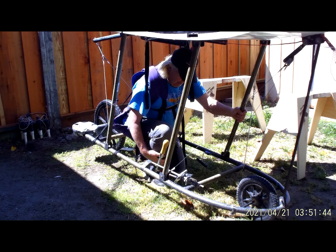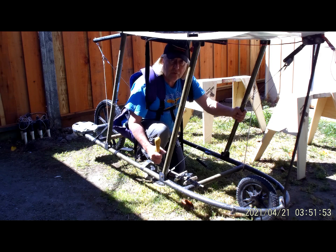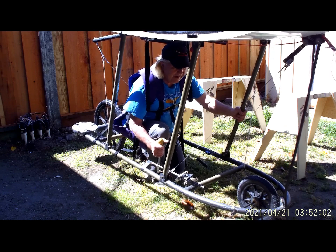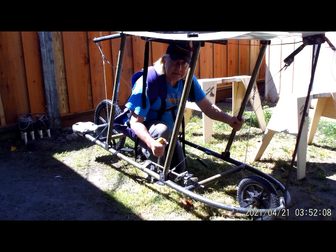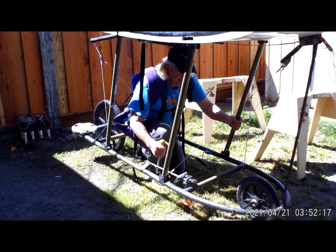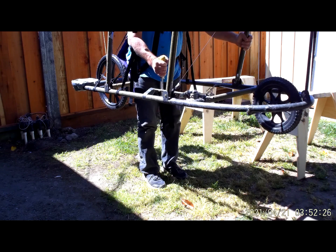This pretty much solves the problem. I did some testing with the lift harness with weights simulating the aircraft weight, practicing indoors — standing up and finding where my body needs to be to do this job, because I'm no Hercules and a lot of other pilots aren't either. I've got to design this so the average person can lift it. You have to be at enough height off the ground so you can get this leg at 90 degrees and get a foot underneath you. That allows me to push with my right foot and lift — and now I'm in a flying position.